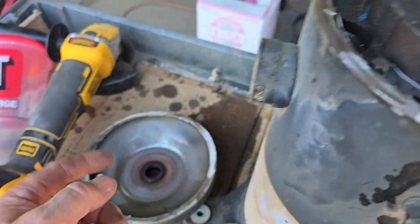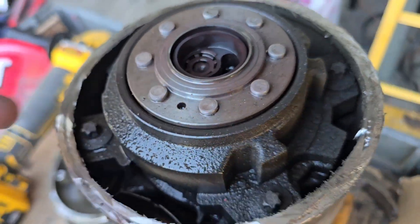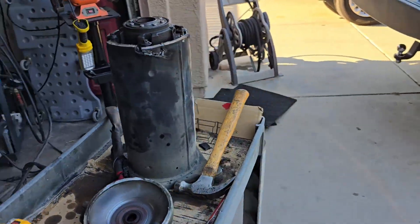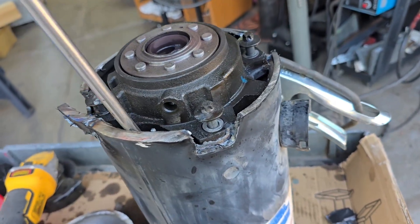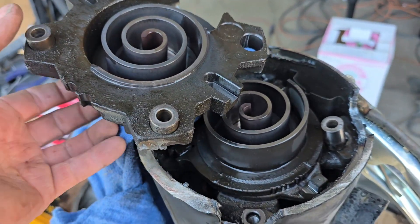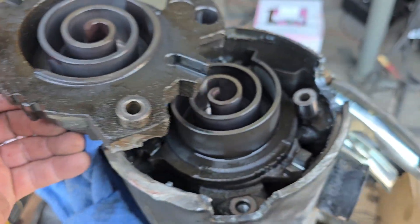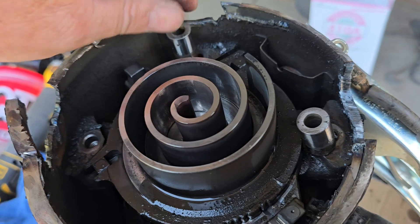Got the dome off. However, if I unbolt this the scroll part's not going to come out — it's gonna hit, I think. It just stinks, gotta get a little medieval on this thing. This is loose now, pretty hot down in there. Just got the scroll section separated. I expected maybe to see something shattered in there, although I guess maybe not because it did pump.